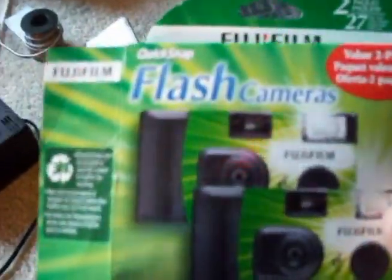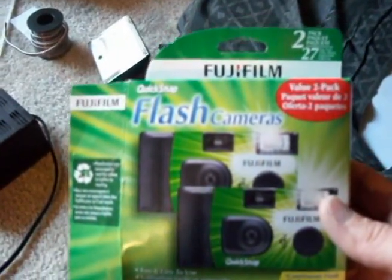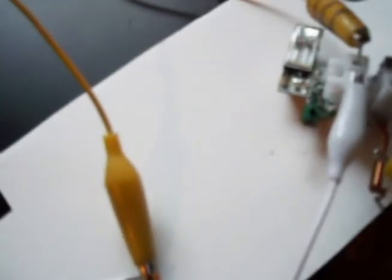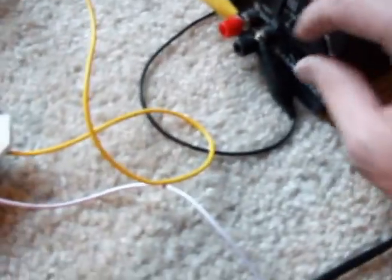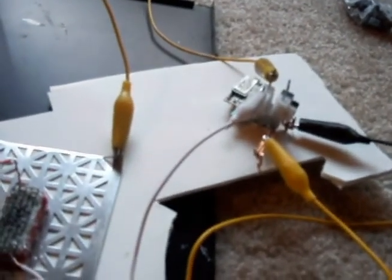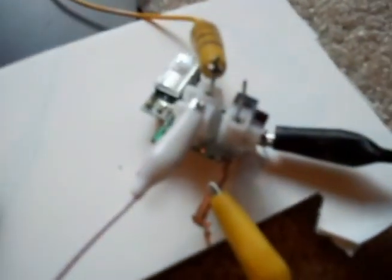Here's my test setup. I got one of these Fuji cameras, took it apart, and I took off the high voltage capacitor and replaced it. I ended up losing the battery somewhere, so I'm using my DC power supply set as low as it can go, which is three volts — which is actually quite high for this thing, since it normally takes one and a half volts. I could very well burn it out, but I do have an extra camera.